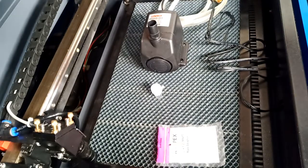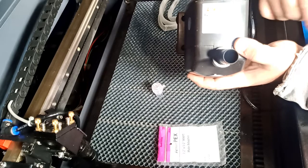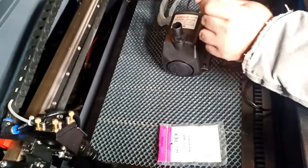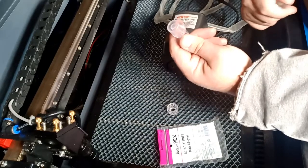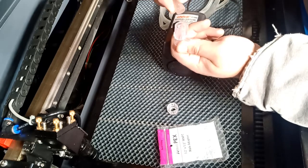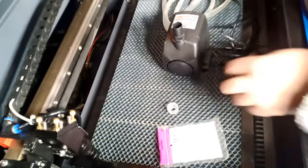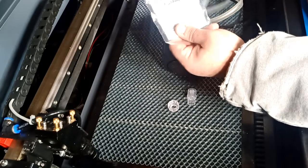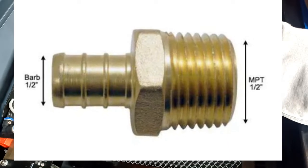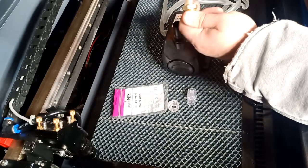Here's the small upgrade I did. This is the water pump — it pushes about 2,300 liters per hour. It's not a bad pump. This is the hose that comes with it. A lot of people were wondering how to connect it. It comes with this plastic piece — you might have lost it, because when I unpacked it this thing fell off and I didn't know it came with it until my son found it. It's almost a half-inch diameter. You can push it in tightly. I went to Home Depot and bought a male adapter, half-inch to half-inch. Do not use half-inch to three-eighths because the opening inside is smaller.